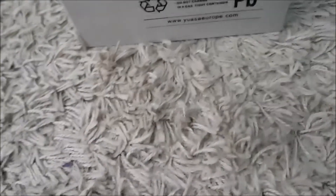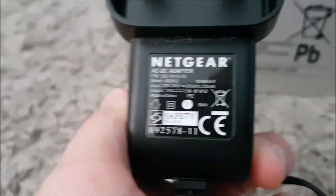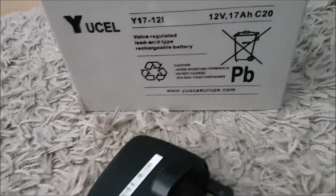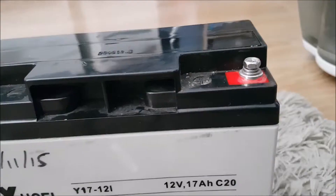You need a Netgear or similar type of power supply which outputs 12 volts at 1.5 amps. You have to strip the ends — as you can see, I've stripped them already. You also need a screwdriver for screwing on the terminals, and lots of patience. Now get the terminal, slightly unscrew it, put the cable in there, and use the screwdriver to fasten it.